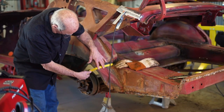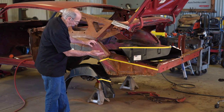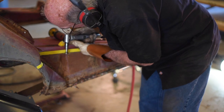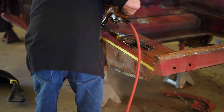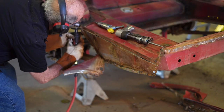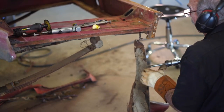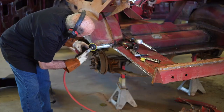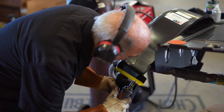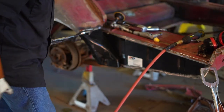Because we're doing this as a tech article and you're probably doing it at home, I've elected to do two things: splice the back of that wheelhouse in and splice the bottom of the drop-off in. You can replace them all, but it's a lot of work to get the whole wheelhouse in the car — it doesn't really need it. So I've laid the tape out where I can cut the bottom of the car below the line. I'm not going to lap weld it, I'm going to butt weld it, and it's a lot easier to scribe the part you're using onto what it's going to be joined to — makes it a lot easier to put them together.